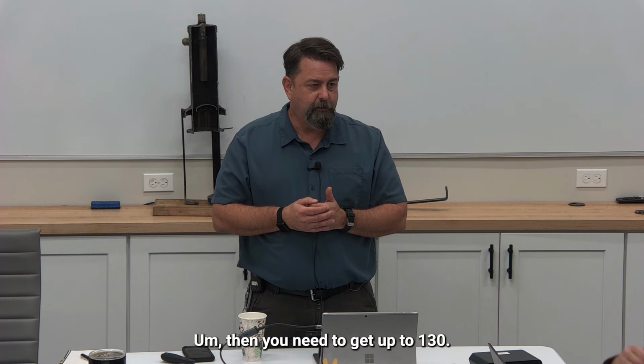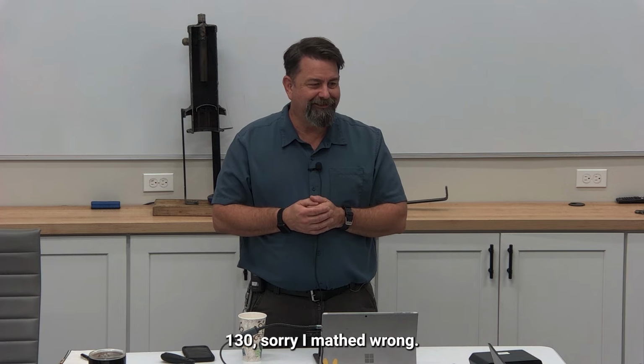Do I want to shut off my fans at 110? No, I don't have any room for my holdback valve. So I've got to be above that. Everything's got to be above here. There's some room to play with. What if I've got a suction of 40? 90 above suction. The highest you want to go is 10 PSI for your last fan. Then you need to be at 130. Sorry, I got the math wrong.